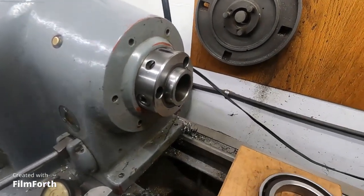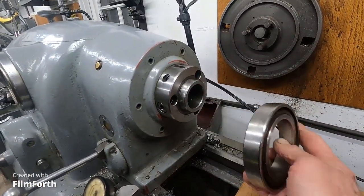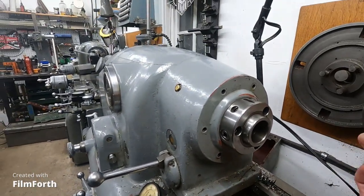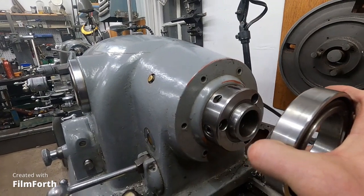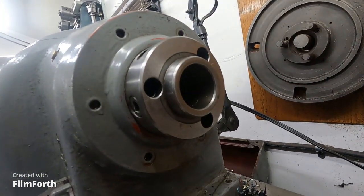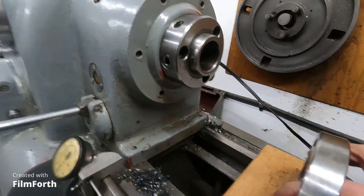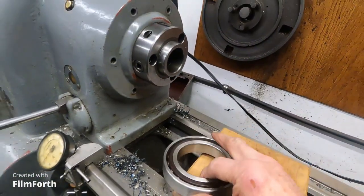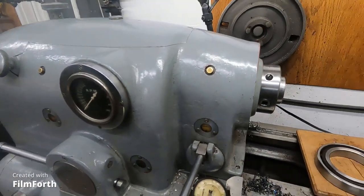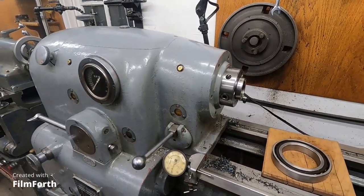The really important thing is to make a mark, because inside the machine the bearing faces a specific direction — up against the back of the spindle, where the high spots are. As soon as you can get to the bearings after removal, mark them and try not to damage them. Then index the inner race — mark inner race to inner race so orientation is preserved.